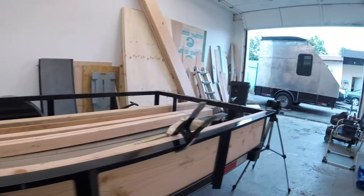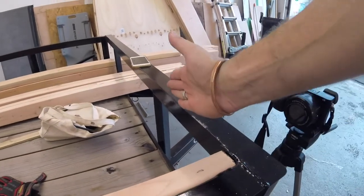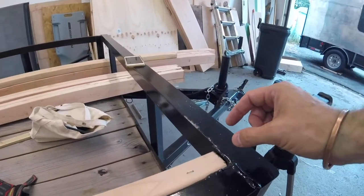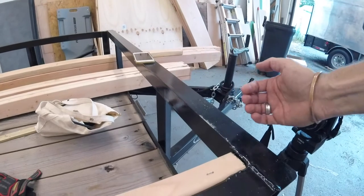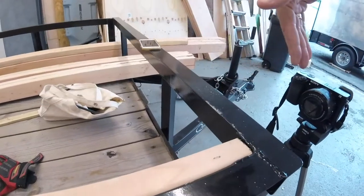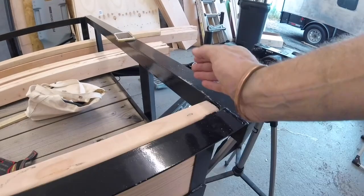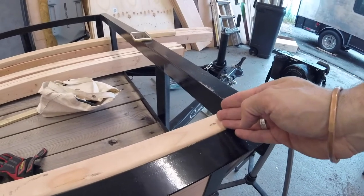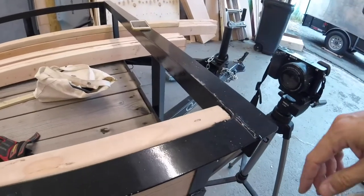One thing we are going to do is move this back an inch and a half, that way the one that closes up the front runs this way. Why do we do that? Because when you're driving, all the rain, wind, everything's coming in this direction, and it's easier for it to get through something that's in the line of travel. Whereas if you go this way, you have the gap between the front two-by-twelve and the side one. You're sealing this up so you're not getting that air pressure — it's just best practice really.